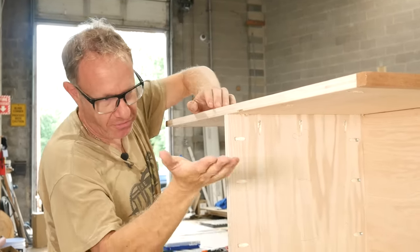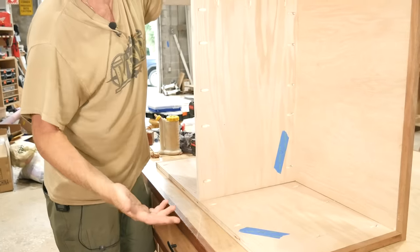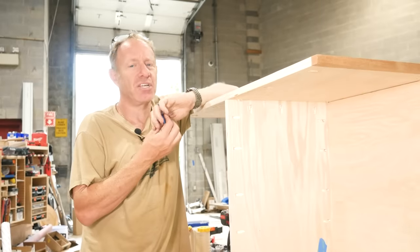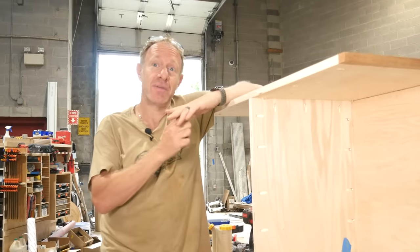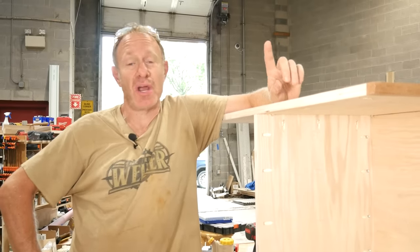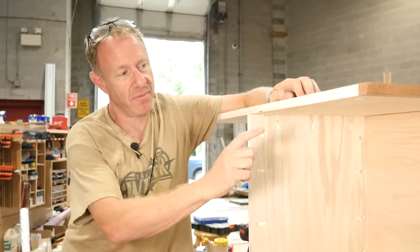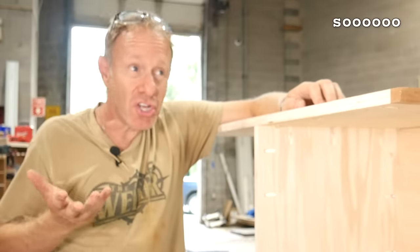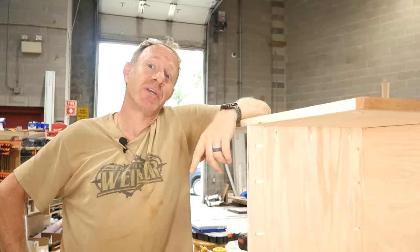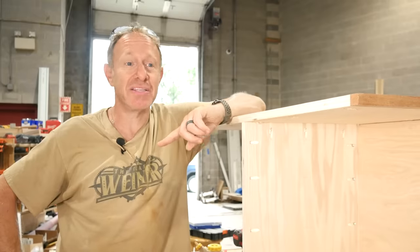I had this idea. We're building three — well, four sets of drawers. The drawers are going to hold sandpaper for the drum sander and other sanding. The trays are just there for extra sanders that we have around the shop that don't necessarily fit on the cleat wall. I had this thought: in the last project we did dados on the RS1000 that NextWave sent us. And then I thought maybe we would do box joints for the drawers. The one thing we figured out is that when we try to do box joints using plywood, the plywood just kind of blew apart because of its layers. So we've got some poplar sitting over there — let's make a couple drawers, learn how to do box joints on the RS1000, and when we run out of poplar, we'll just make the rest out of plywood, which is how it is on the plans you can get on our website.